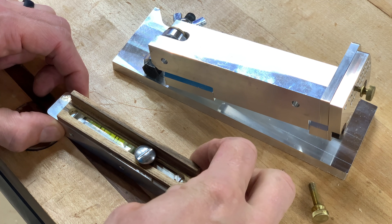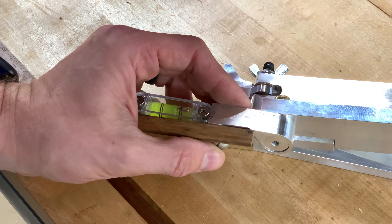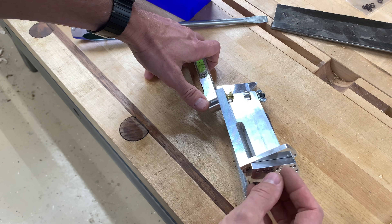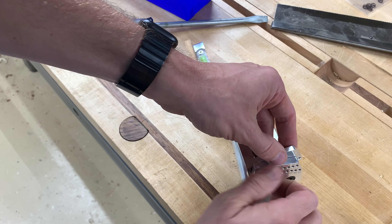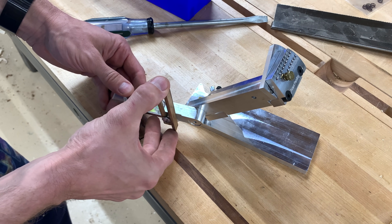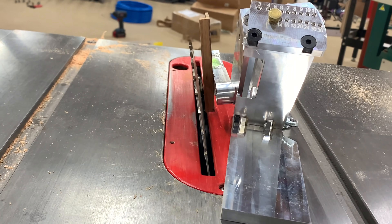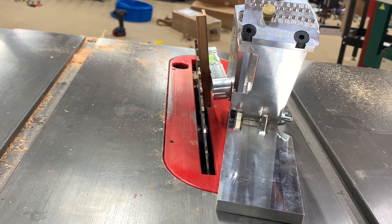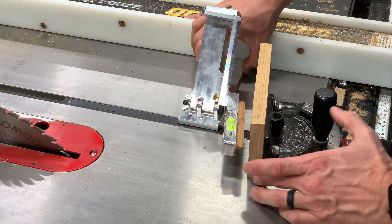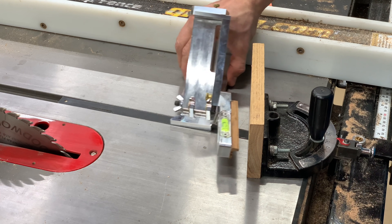So let's get started. The piece I added maintains the same plane as the reference face of the jig, but it has a longer contact length with the blade, so it's easier to see when you have the angle set perfectly. It folds down so that when you're setting the angle of the miter gauge, the functionality is unaffected by the add-on. So the pieces that I cut should come together without any gaps.